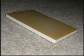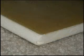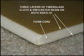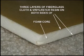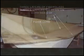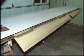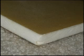The basic fiberglass composite material used in the construction of a Glasair consists of a sandwich of three layers of fiberglass cloth and vinyl ester resin on both sides of a 4½-pound styrofoam core. The outer surfaces or skins of the fuselage, wing, and control surfaces, which are part of the kit, are molded by the Glasair factory in the same manner.